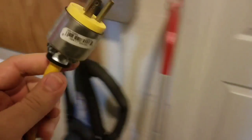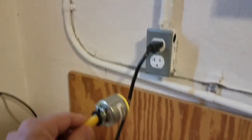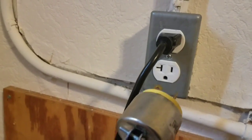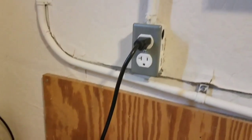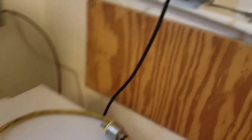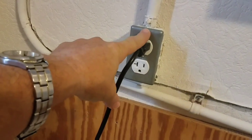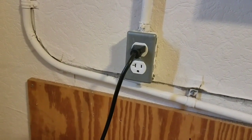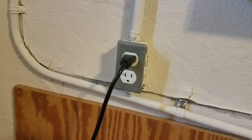Now we're indoors. Here's the hole in the wall where my cable comes through. I built myself a cable with another 20-amp male end on it — clearly 20 amps — and this is going to plug into this 20-amp outlet. The outlet used to have a 15-amp duplex outlet on it; I've changed it to 20. This is my freezer right here — in the event of a power outage when I need to run the generator, this will be unplugged. Now this outlet is a dedicated circuit. There is nothing else on this entire circuit. It goes up to the attic, straight back to my main panel.